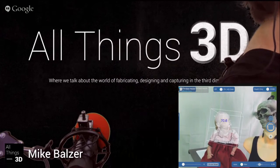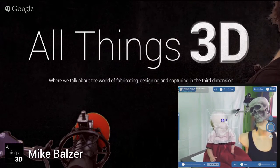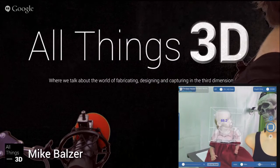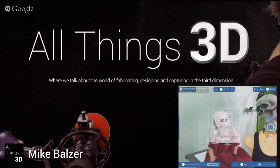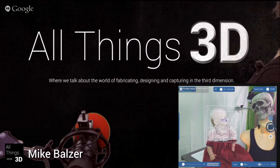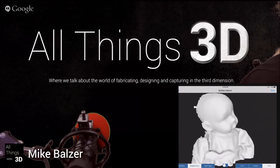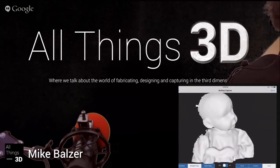Now notice there's a distance measurement in the middle there. I found this very useful, especially with color textures, because it allows you to keep your reticle on the object, and it senses where you're at so that you can keep the distance of the sensor to the object. And this is very important for textures later on. Okay, so that should be smooth enough. So there you go. And as you can see, there is some surface noise there that will have to be smoothed out later. I may include a smoothing routine, or I'll just leave that to external software.